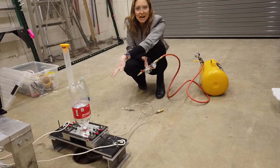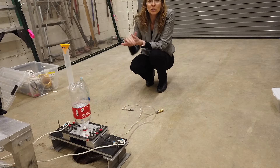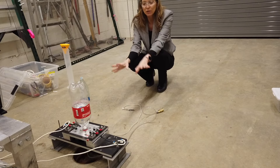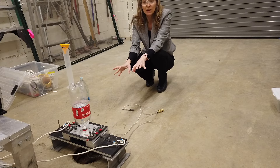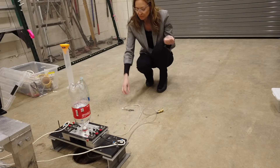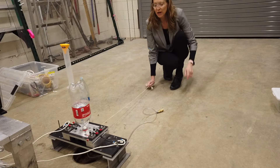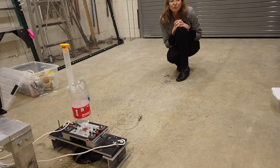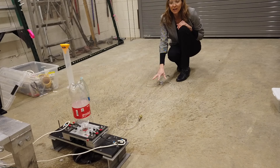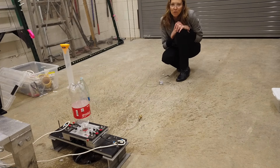Coordinate with your indoor team members operating the VI — there will be a separate video for VI operations. They will zero the load cells, and you have only five seconds from zeroing to take accurate dynamic data from the sensors. Once they confirm the sensors are zeroed, start a three, two, one countdown and release the clamp by pulling the string, expelling all pressurized air and water from the rocket. That thrust will be measured as a function of time using the LabVIEW VI. If you have any questions, please ask me or one of the lab assistants.